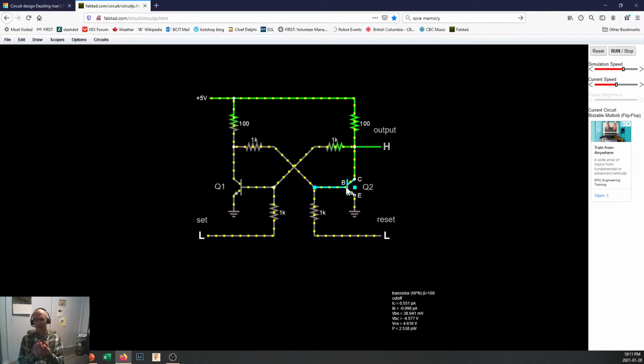Now, you're thinking the transistors that we use to make your Winky blink, and in fact, if you look at this circuit, it's not so different from a Winky blink. It's just there's no capacitors because we don't need to time anything in here. We've got this circuit right on here, and we're getting a high output coming off here. The big transistors that you're used to looking at in your Winky blink, of course, get shrunk down onto microchips, and we can fit millions and millions of transistors onto microchips, so we can store huge amounts of memory in tiny little microchips now.